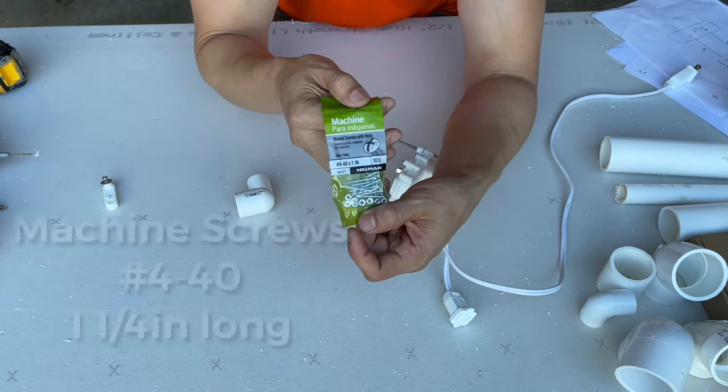Okay, so now to the complicated part. The reindeer motor goes in a continuous loop. We need this to go back and forth to do the waving side. The issue is the only way to do that is to stop the motor from going to the right and from going to the left. So we have to obstruct it with something.